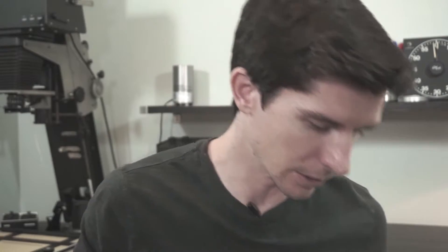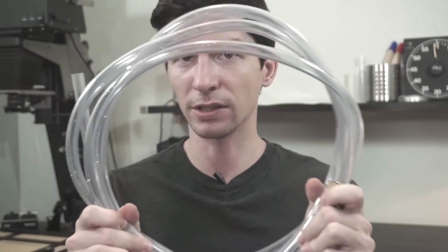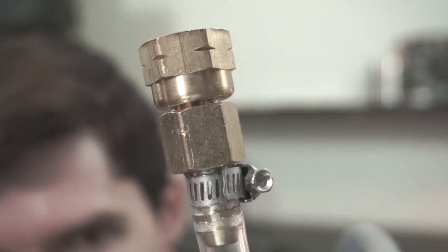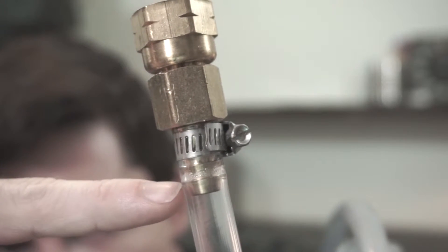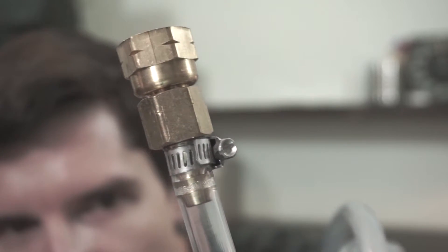To connect the print washer to the diverter, we did a little Home Depot finagling. I bought a section of half-inch tubing — this is a 10-foot section, about $6. I also bought two brass fittings. There's a half-inch connection at the top which goes into our diverter, and then a three-eighths inside-diameter fitting that connects inside the hose. This is called a barb — the barb goes inside the tubing and you clamp it down with a little hose clamp. Let's go hook this thing up and I'll show you how it works.